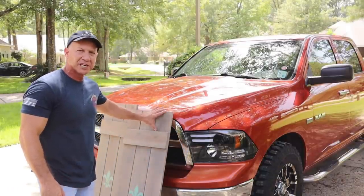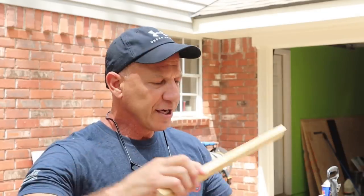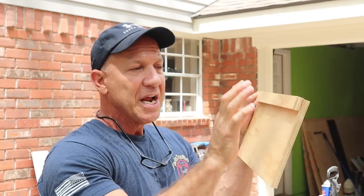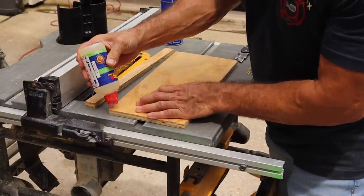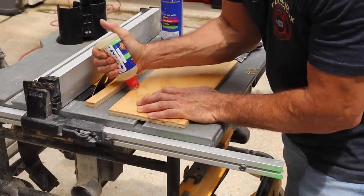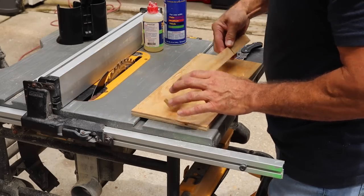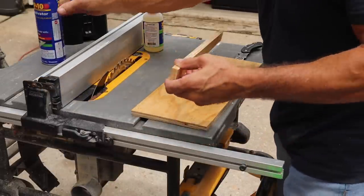I'm going to give you tips and tricks. The first one is a template — a simple little template that's going to enable you to just roll these things out. This board is seven inches wide with a one-inch strip, so when I put these together I'll have a six-inch space across the width of my shutters. I'm using 2P10 — a FastCap glue, an instant CA glue that works really well, two-part. I like to use the thick or the gel. I'll put glue on one side, spray the other side, and put them together.